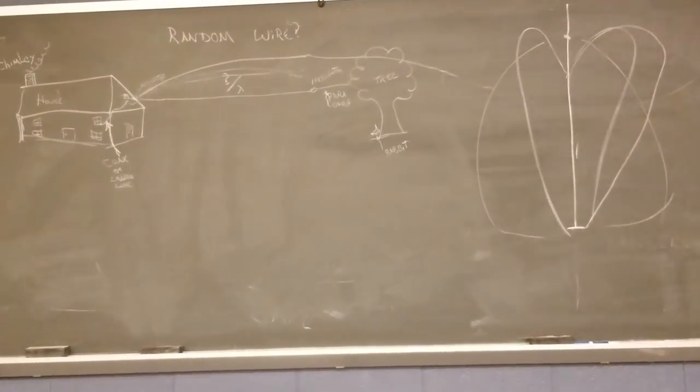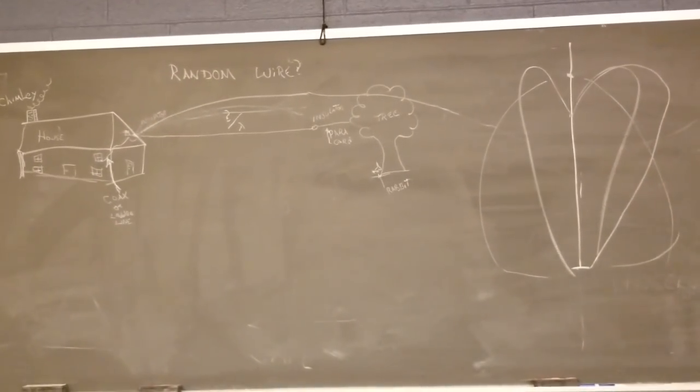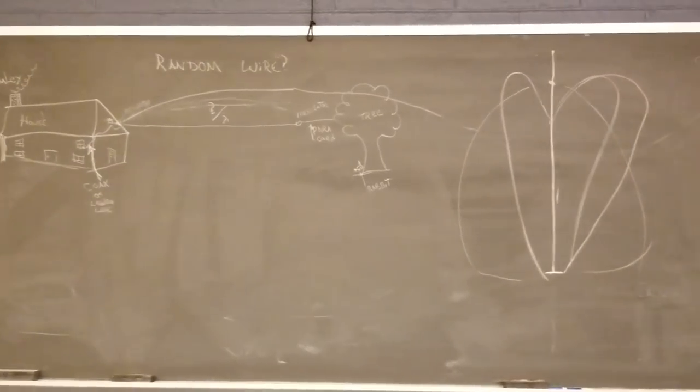Okay, if nothing else. Like the height of the ends, were they secured? Well, I put them up as high as I can. I used the wrong military poles. I used fiberglass, and my end started out up about 40 some feet. And then the fiberglass would chip and break and fall off, and I'd go back and put them on again. So I went to metal ones. I don't know where it stands now, but I know it's a lot higher than the electrical service wires around the farm. So they're up there pretty high. The higher you go with it, the better it's going to work, because you get away from the ground effects. And your radial is the same length as the wire, 148 feet?